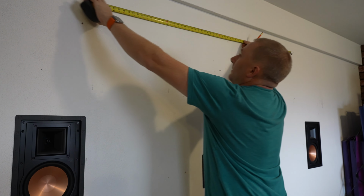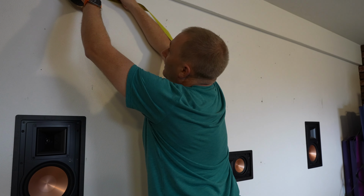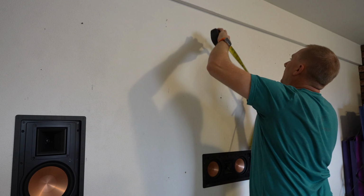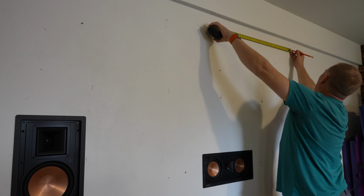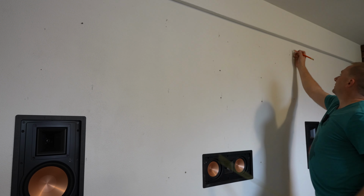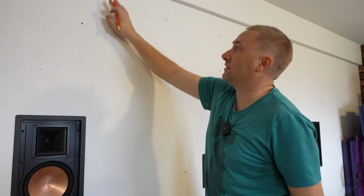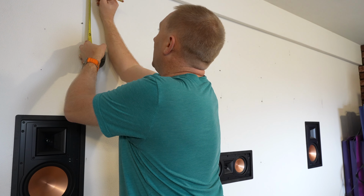So essentially, I'm going to come in here. I'm going to put my bracket here. That should be a stud there. And I even have a hole there. That's the other stud. So that's a bracket location and bracket location. That's where my brackets are going to be. And like I already said, the bottom of my bracket, I want it to be about 3 1/8 down.